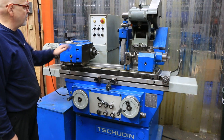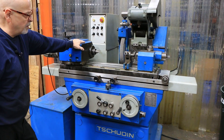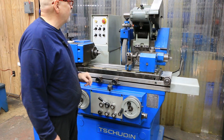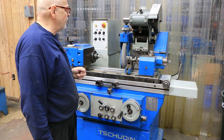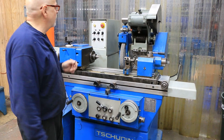This is equipped with a live and dead center spindle. Morse taper number four is the main spindle, and then you can have different reduction sleeves to give you a number three or number two taper. The tailstock is a number three Morse taper.